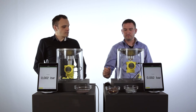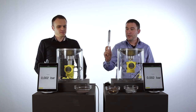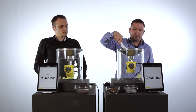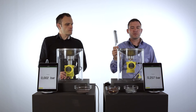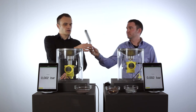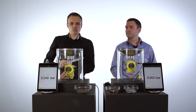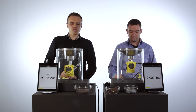Sometimes we have tough build-up on our cells, therefore we need a brush with more force. Let's use the metal brush and clean the ceramic cell really tough, really hard. You can see the force on the cell — the ceramic cell comes back and the value is absolutely as before. Now cleaning the metal cell with the metal brush, we can see scratches on the membrane, which means the value can't come back to the original value — we now have an offset on the metal cell.